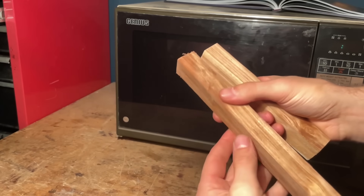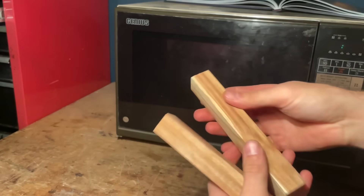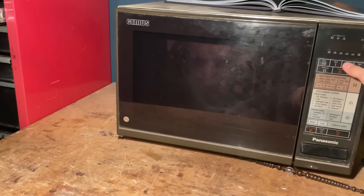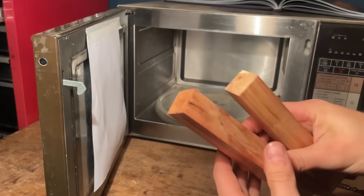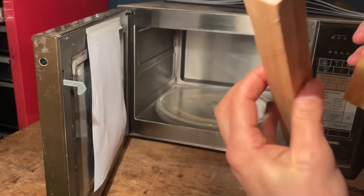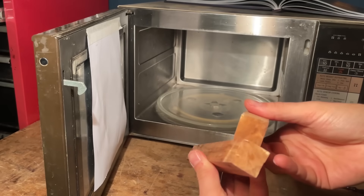You can see I've got all dark heartwood now — there's a bit in the corner here but that'll just turn out. I'm going to stick them into the microwave again, just for a quick blast as they're still a bit damp. You can still see there's a bit of moisture actually coming out in the centre there. But I'm happy enough to turn this now because it'll be dry enough — it'll still dry about the lathe, but the important thing is it's not going to bow, twist, or split.